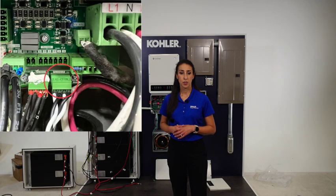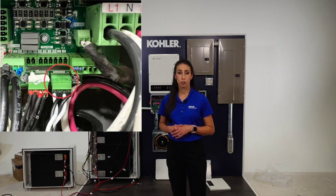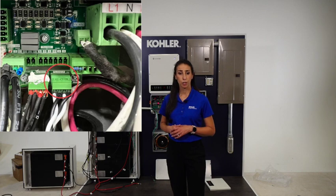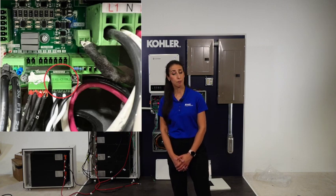Next we will connect the CTs. The current transformers are required for the system installation to detect grid current direction and magnitude for proper system orientation. The two grid CTs must be installed on L1 and L2 on the home's main utility entry cables. L1 and L2 are determined by the grid connection marking on the inverter. Make sure that the AC cable is completely isolated from AC power before connecting the CTs. CTs are labeled either L1 or L2 and must be facing the correct direction. The house side of the CT must face the main panel and the grid side must face the meter. Route the other end of the CT through the CT port and insert the four pin terminal at the inverter as shown. After all the wiring is completed, close the wiring distribution box.